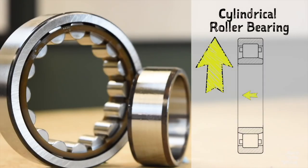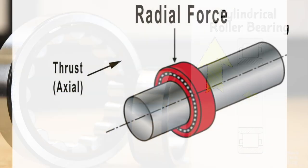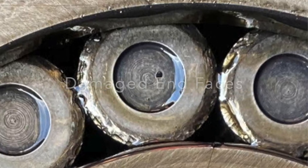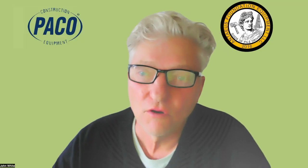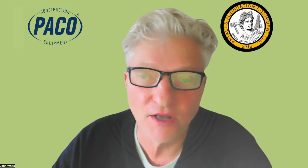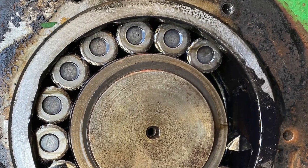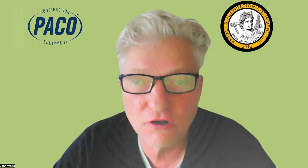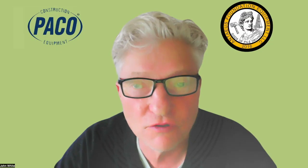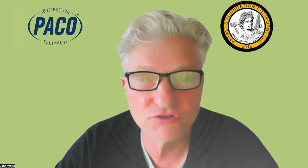The cylindrical roller bearing can support exceptionally high radial loads. However, it has almost no thrust load supporting capacity because rollers are not designed to contact the races on the end faces. What that means is you can't really use a straight roller bearing when driving batter piles — when you lean the vibratory over, it's going to jam the rollers up against the inner race and chip on them. That's the first signal to look for when a gearbox fails. Did it get side-loaded? Did it have straight roller bearings? If so, you probably destroyed the bearings.